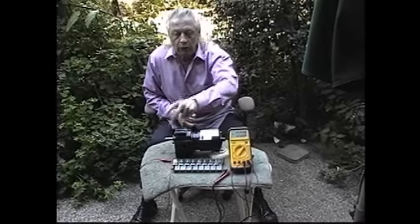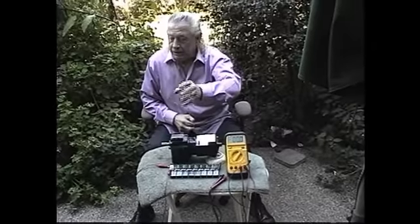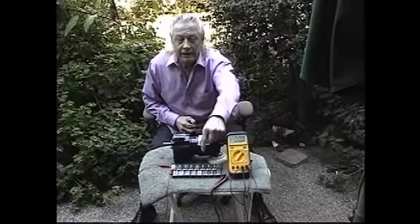We don't have a load, so you know it should be a lot less than 2.2 amps. It should be down around 1 amp or something that it is drawing. But my point is, it will kill these batteries the instant I hook to it, and the shaft of this motor won't even turn. Now there's something I want to tell you people about AC power.